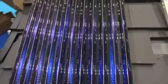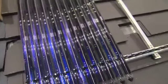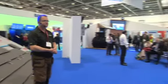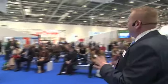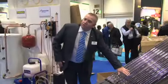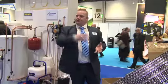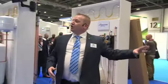And I wasn't quite sure what you said about the degrees. Yeah. But how about orientation? Right, orientation, then obviously we know south facing is ideal, 90 degrees to the sun. But with our tubes, if we are just south-east or south-west of south, we can twist the tubes. Because we've got a flat absorber plate, we can twist the tubes up to 20 degrees to gather the sun from the south. The good thing about these is they work on light as well as heat. Lovely. Thanks very much for that.